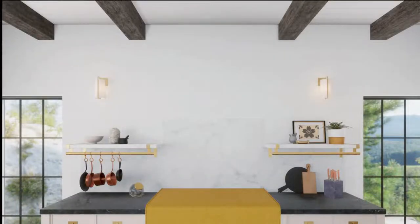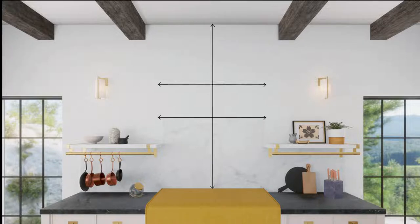For ceiling venting, install the hood onto the wall by measuring the desired distance from the bottom of the hood to the cooking surface — 24 inches minimum over an electric range or cooktop, or 30 inches minimum over a gas range or cooktop; the maximum is 36 inches. Use a level to draw the cooktop or range centerline, draw a horizontal line indicating the bottom of the hood, and draw another horizontal line 16¾ inches up from the bottom of the hood indicating the location of the installation bar.